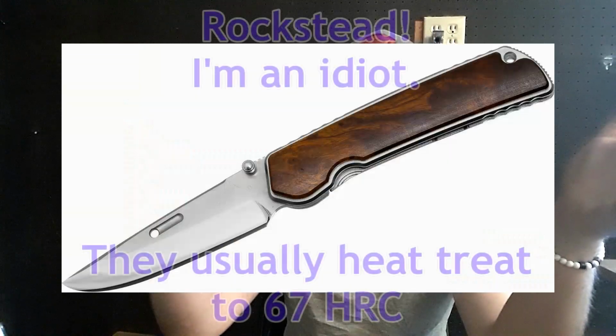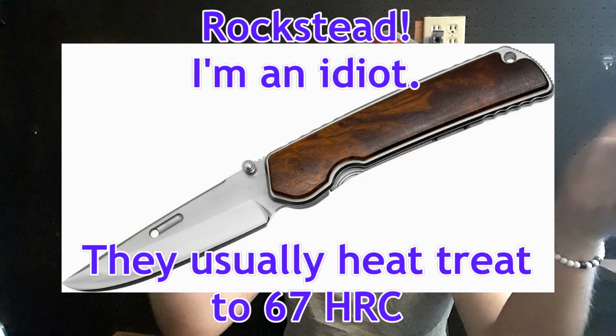Guess which ones are used for knife blades? Locked in your answer? That's right, it's C. Whenever you're looking at the HRC value of your knife blade, that is the C scale of Rockwell hardness. Typically, knife blades, ranging from simple steels to high-end stuff, are anywhere from about 55 HRC to 70, which is really, really high. Those fancy Japanese ones, like ZDP 189, I can't remember what those are. Anyway, that's what we're going to be working with in this video too, the HRC scale.